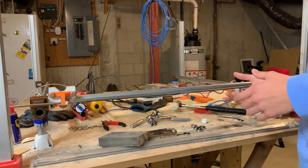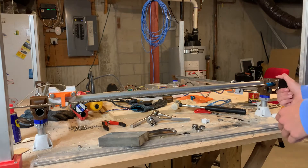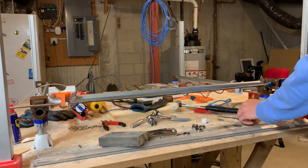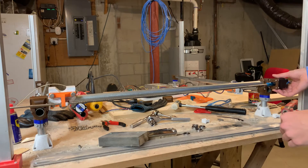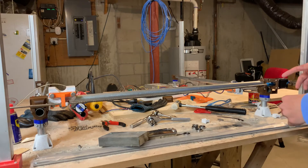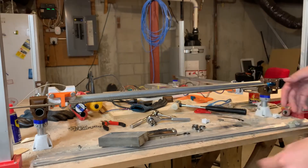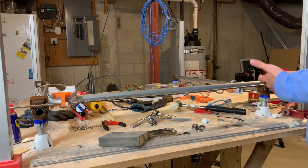But I don't want them all set up like this one, because after assembling it I see it has some problems. This oscillates, probably because of the thin mounting, or the screws I am attaching this to are too long. So I had to use nuts, but I didn't have washers thick enough, and so that can also create a weak mounting. I might need smaller M3 screws.